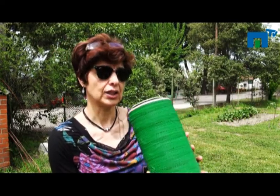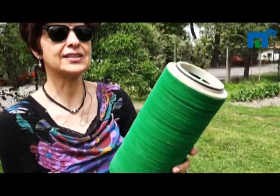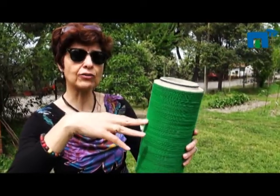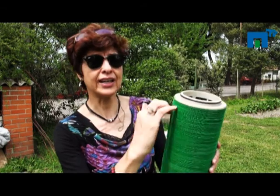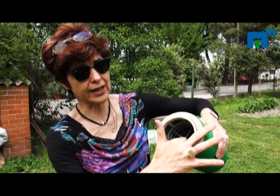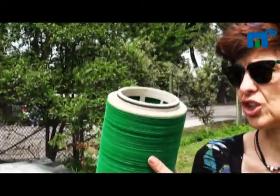In order to avoid that disadvantage, you have to add a filter to the system. The most typical filter for a drip irrigation system is the disc filter. This is a very fine disc pressed together. Water comes from the outer part, all the material carried with the water stays on the outer part of the discs, and the clean water comes to the inner part and moves to the irrigation units.